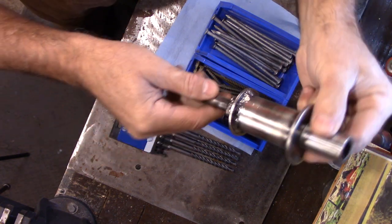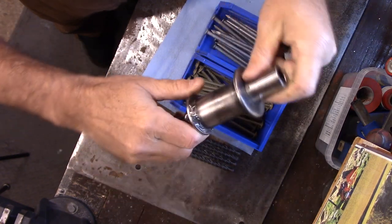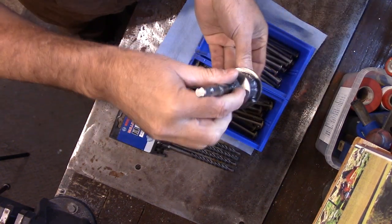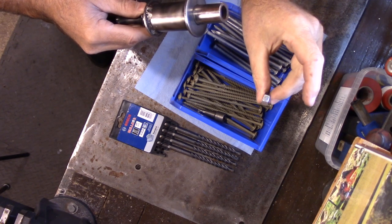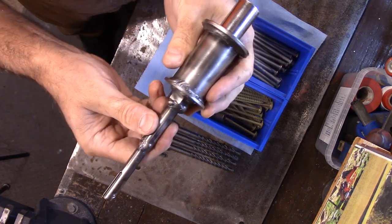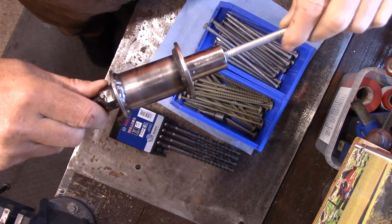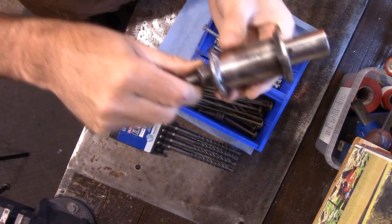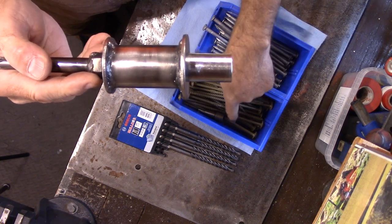There she is — welded all the way around here and here. To set the depth, I just put this nut in here like this, and when I put it down it sets the depth — about a little more than a quarter of an inch, which will be fine. As you're pounding in your nail it holds it in there, and when you get close to the wood this collar backs down to set the nail at the proper depth.